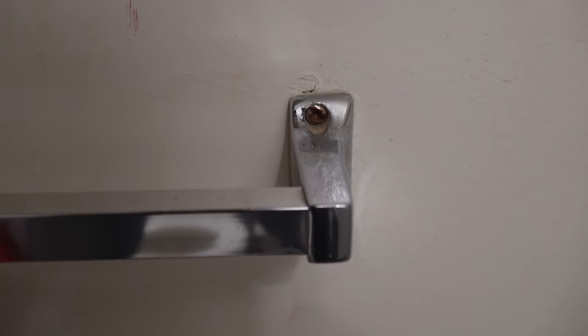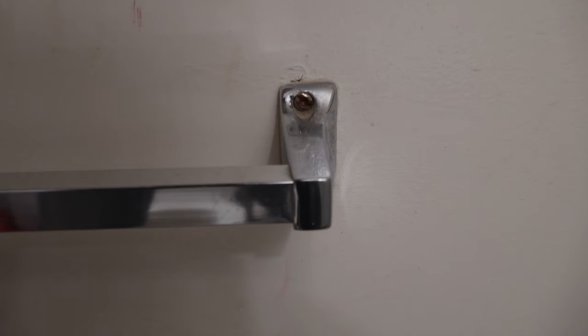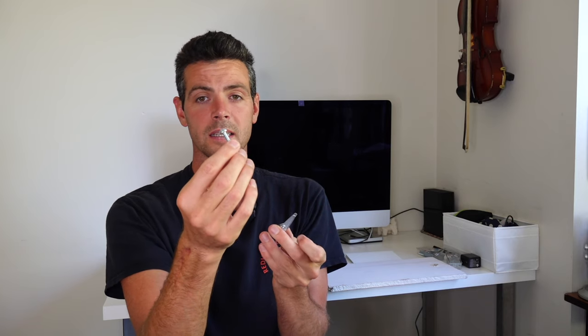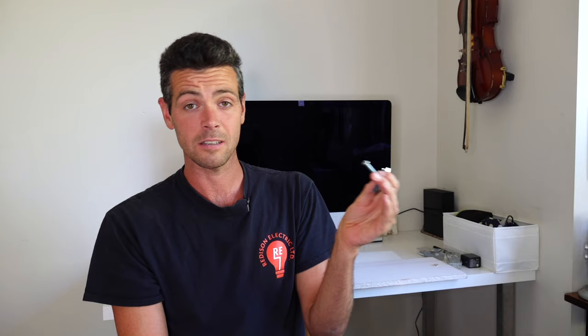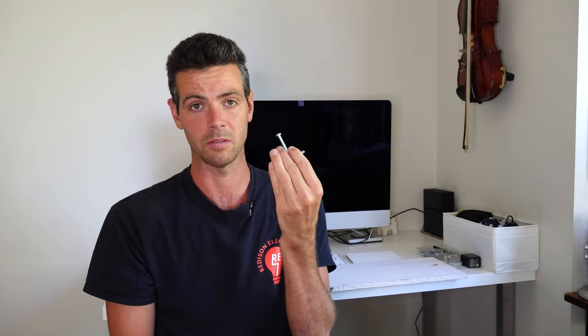One last thing: if the screw is exposed — like on a cheap towel bar — because it's not stainless steel it's going to rust over time. If you can find bolts made out of stainless steel that fit, I'd recommend using those for bathroom fixtures exposed to moisture. The bathroom where I installed this towel bar just had a toilet and sink, no shower, so there wasn't going to be a lot of condensation. But that other towel bar I showed you is in a shower and that's why it's rusting. Hopefully you found this video useful — thanks for watching Vancouver Carpenter, till the next video.